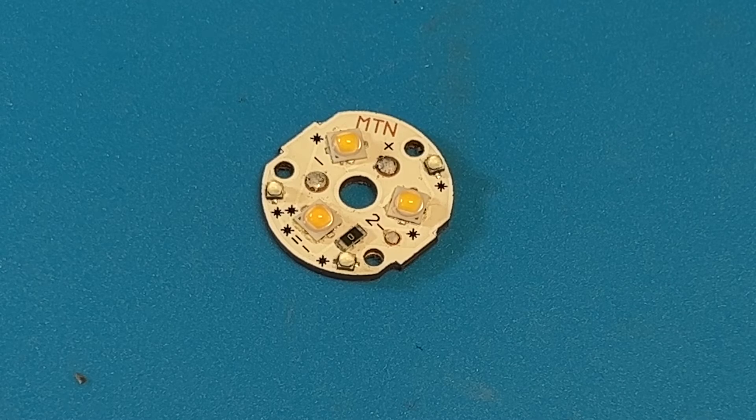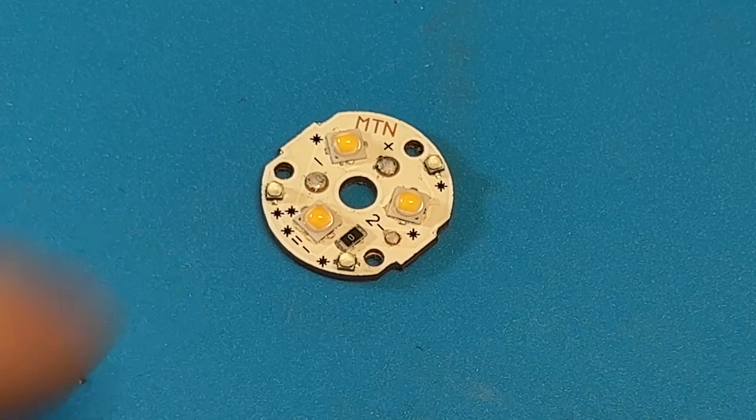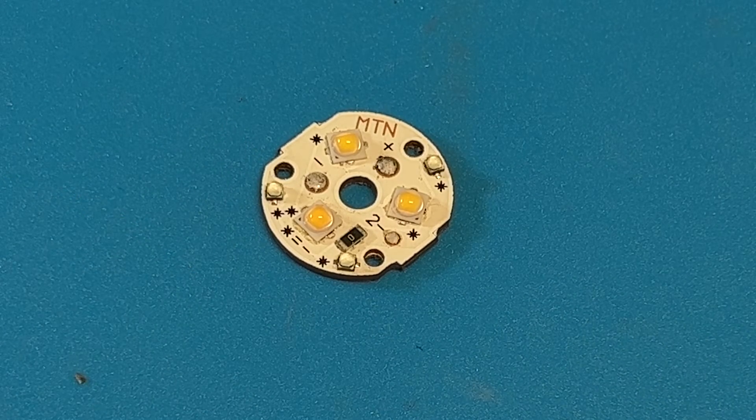I hope that's useful — it's something I left out of the last video and some people commented on it. So there are two ways to test your emitters before reinstalling: a digital multimeter with a diode setting, or a bench power supply. Here's a third quick-and-dirty way: use a 9-volt battery. The voltage is high but the amperage is very low, so just touch the leads to the board quickly and they'll flash. Just don't leave it on too long.